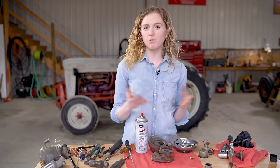I went over to my socket drawer with this piece and picked a socket that is appropriately sized to help me drive this in. So you can see that once I put the socket on top of there, it's gonna hold it in. It's hard to do with just two hands. I almost need a buddy for this. And then I'm gonna tap it in with the hammer until it rests and is flush. I'll follow the same steps on the other side with the plug and on the choke.